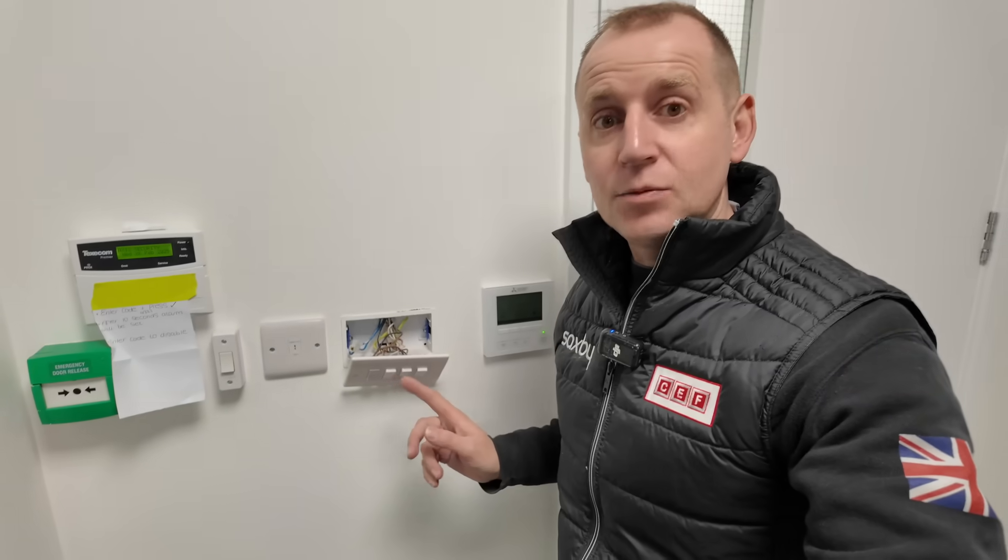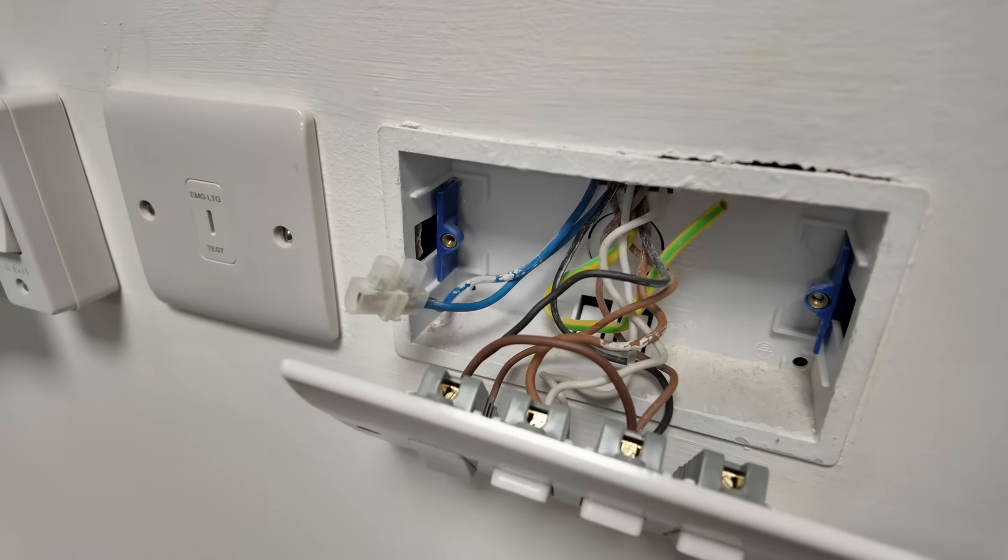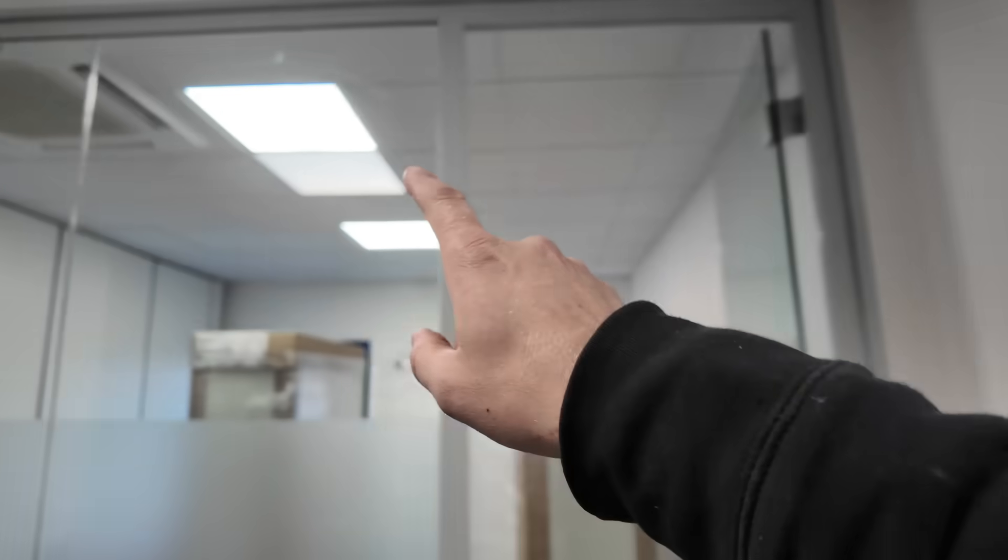Still loads to do today though. I'm back at that commercial job where these lights and these lights are not working — that's a reflection. Not working. The supply has basically been lost somewhere and I've traced it back — it's on its own breaker and I've ditched that. There are two more supplies coming into this switch here. Personally I don't like multiple supplies into a single switch because you have to isolate everything, and if you turn one set off you might think the switch is dead when it's not. So what I've done is ditched the old supply and put a loop feed over, which has now turned those on, those on, and those on.